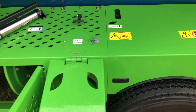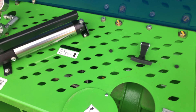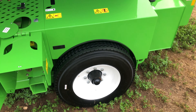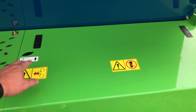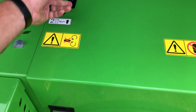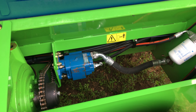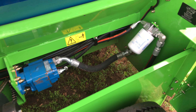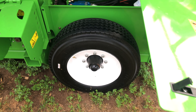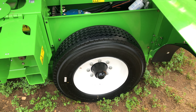Coming around to the other side, we have access for the gearbox for maintenance located here. We also have a main service door for the other side where the hydraulic pump is located, and also for service when removing the wheel. For switching between bagging and transport mode, it's located here as well. The hydraulic filter is a spin-on type and is easy to access from this compartment. The chain drive is accessible for service from here and also features a hole in the cover plate for oiling that chain without having to open any covers.